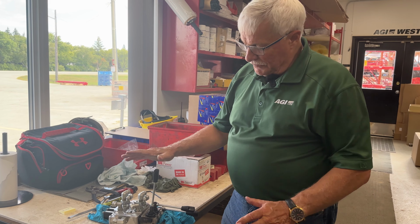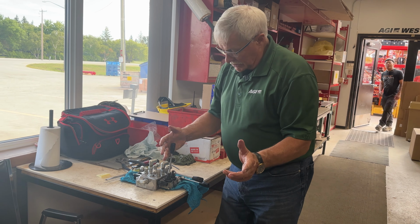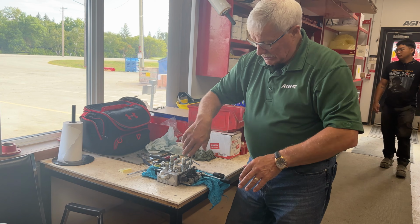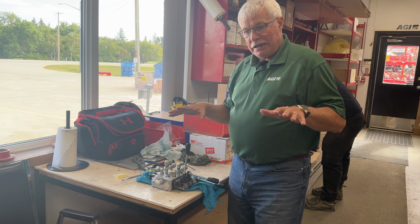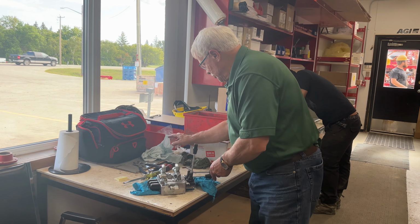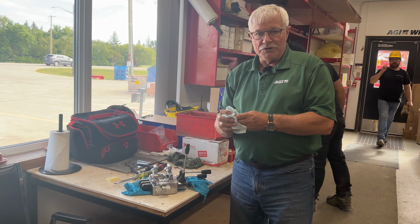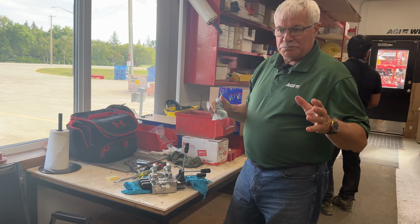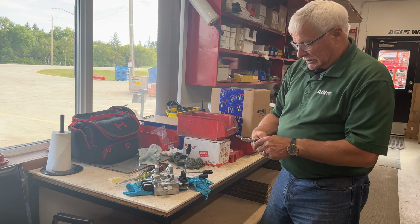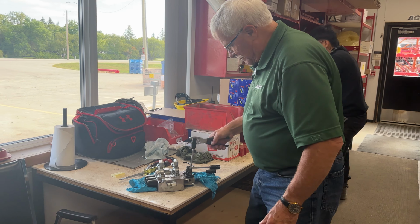But sometimes when you want to retract your extend, it might only go one way. It might only go down underneath the truck, and you want to pull it back and it won't come back. That is flow restriction in this gadget right here. This is not something I would want you to take apart ever if your valve is working. It's not something you're going to adjust pressure or anything like that. But if your valve doesn't work, then we're going to make an assumption that the flow is impeded, so we're going to pop this cap off.